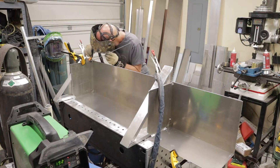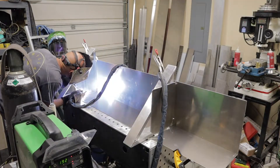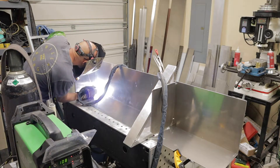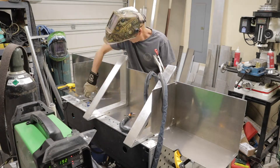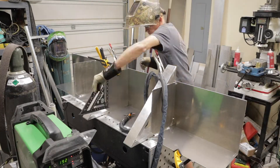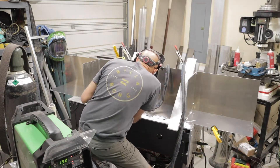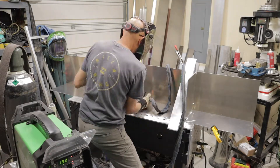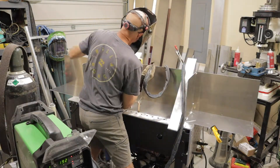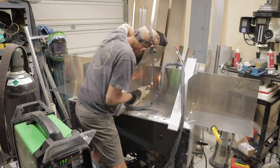I'm spacing out the two on the ends because I've only made two of these fabrication squares so far — I plan on building another one or two. Right now I'm just tacking in those baffles. What this does is allow the fuel to flow underneath through the cutout corners, but it also strengthens the tank in the middle and gives it some structure. I'm making sure everything is square and lined up before getting it all tacked in, and once tacked I'll put the other side on and then fully weld out the baffles to the sides.